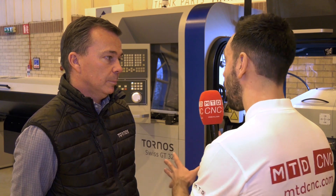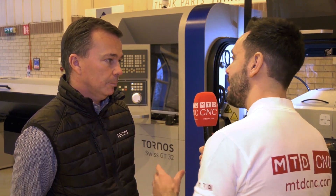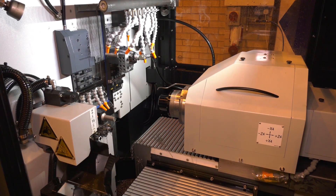For people who have done work like this on a fixed head lathe, if it were high volume, you'd want to consider doing it on a sliding head. You're going to win on cycle time, and this machine is currently being run bushless, so we're reducing bar waste and tooling costs as well.